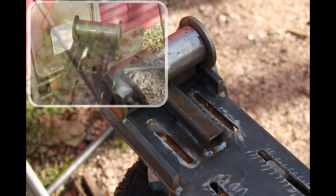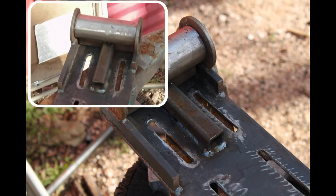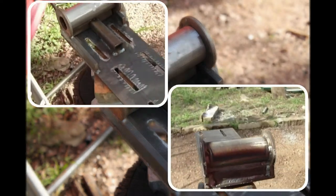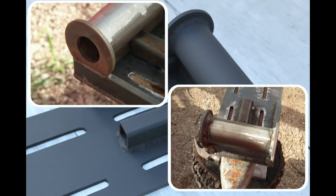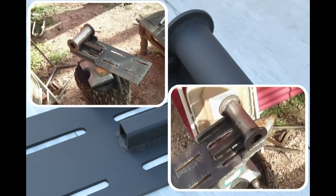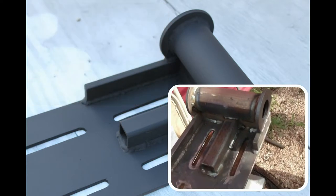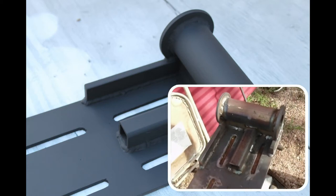Here is my jack shaft plate that I created. It was flexing under the torque of the engine, so I'm beefing it up. I'm tacking on some extra material. You can see I've welded it up on the bottom right — got all the welds on there. You can see in the background that I've painted it. It looks pretty good and it's going to be a lot stronger than it was.